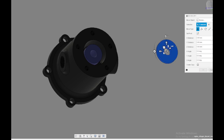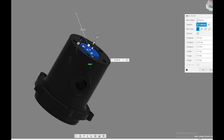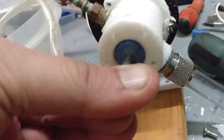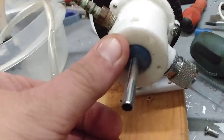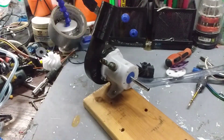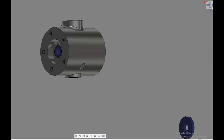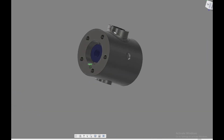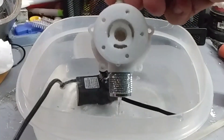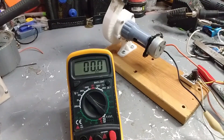I chose nylon because it's probably the best option for any plastic material in this application. This design also uses a nylon thrust washer — basically a large nylon washer attached to the shaft — with just enough clearance between the inner part of the bearing and the outer end cap. This doubles as a seal, referred to as an oil slinger: as lubricant comes out of the end of the shaft it is flung outward to the cavity wall rather than leaking out along the shaft exit, or gland. For the test unit I only used one slinger and one thrust bearing, though in practice I'd prefer one on each side.